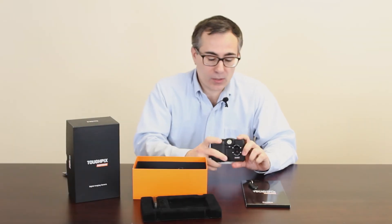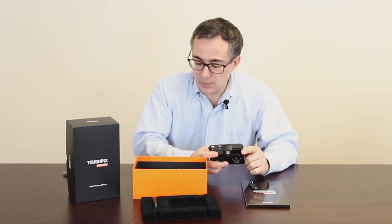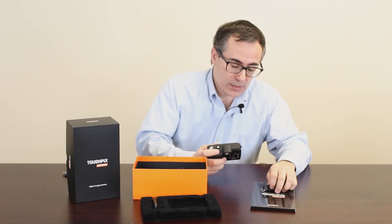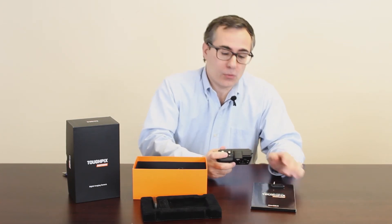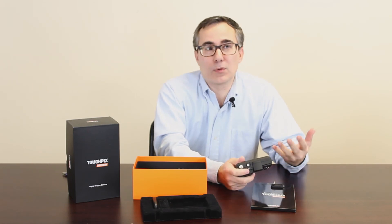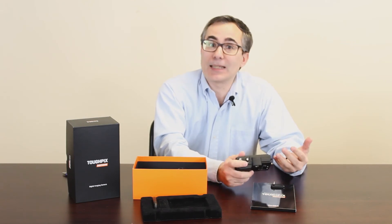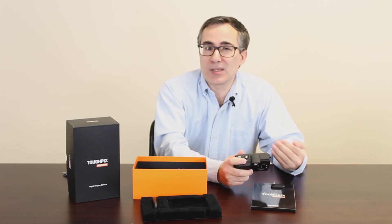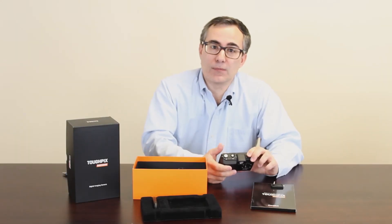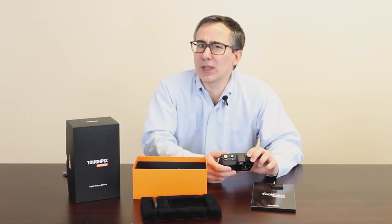As for the camera features: there's an LED flash, it's five megapixel as mentioned, and it has a motorized focus. For close-up work, the best distance is five to ten centimeters — helpful if you're taking a nameplate off a motor or reading lettering in a work area. The camera has three modes: visual only, thermal only, and a blended mode they call ATB.